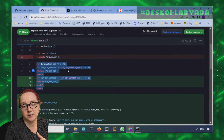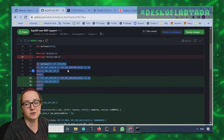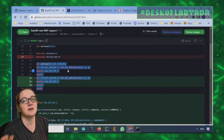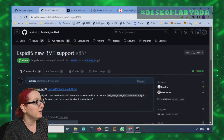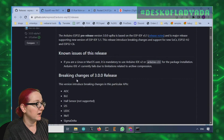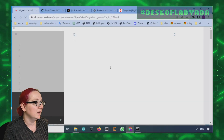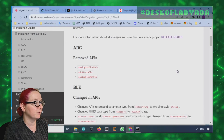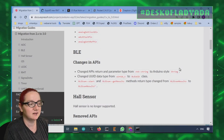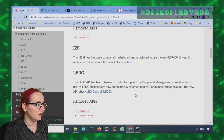You're going to see a couple of these things come in as the board support package version 3 distributes out to the release candidate coming next week, and then eventually the full release. Espressif has release notes but they also have a migration guide, which I would recommend checking out. They go through all the changes, and a lot of people are going to be affected — stuff like analog digital inputs and the ADC API changed.